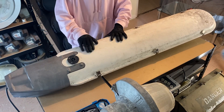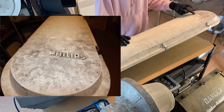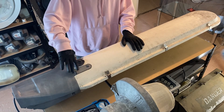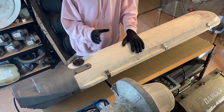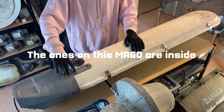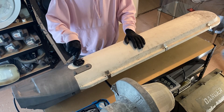This one is fitted with a NEMA socket up here. The Philips branding is at this end - you've got the Philips logo as well as the Philips branding. At this end you've got the NEMA socket which sits on this sort of perch here in between the four bolts that hold the shoe on. Earlier versions of this lantern had the bolts that attach the shoe to the fiberglass canopy situated on top. This one has a 0392 date code on the photocell which dates to March 1992.